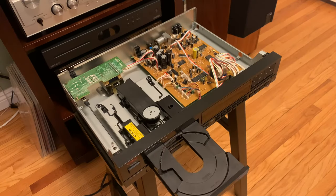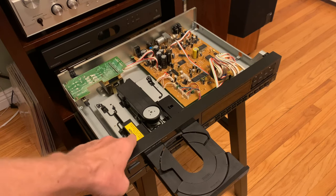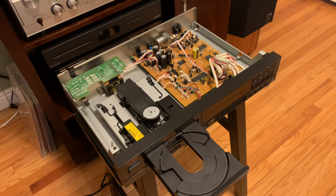I've removed the top and taken a couple of precautions. I've already opened up the CD tray and then turned off the machine, and for safety's sake I've unplugged it so there's no power. But we've got to be careful — capacitors could be holding a charge and might zap you. Also, if the unit was running, there's a caution label saying there's an invisible laser beam that could be damaging to your eye. So just a couple of things to think about.